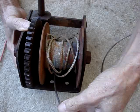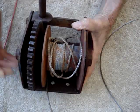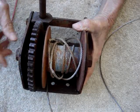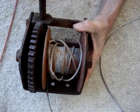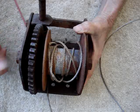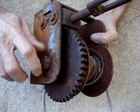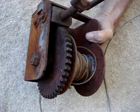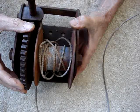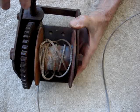When you pay out the rope and hook it to your load, there's still a lot of slack in the rope. So I want to make a small hand crank so I can hand-crank it up — because this is a worm winch and they work excessively slowly. I want what I call 'rapid pay-up,' like a two-speed winch effect. I could put a ratchet on the nut or a hand crank to take out all the slack, then swap over and use the worm drive.